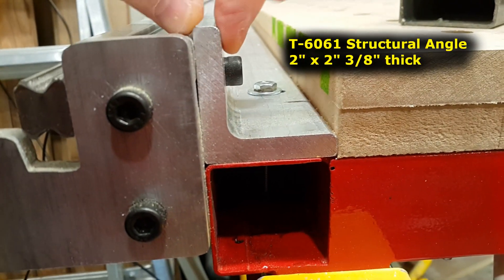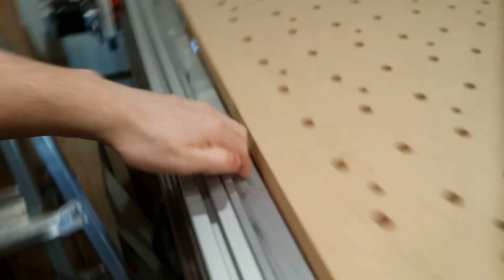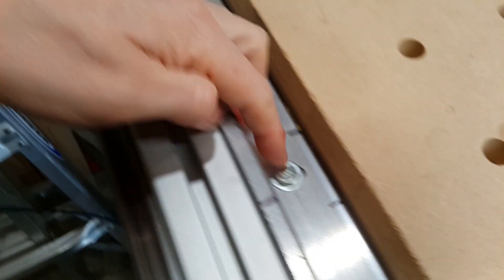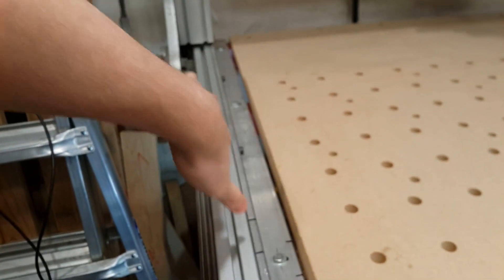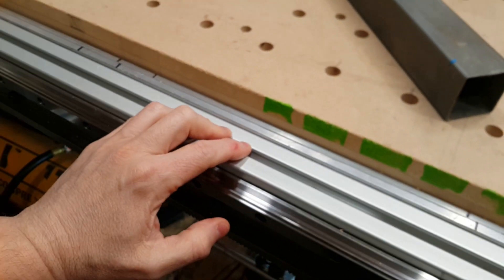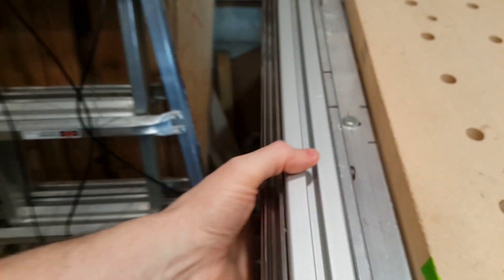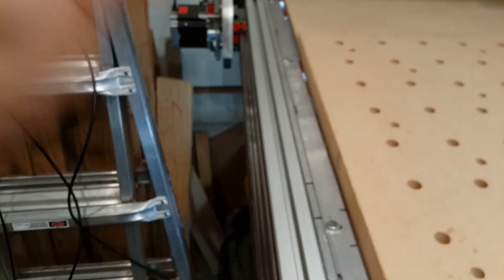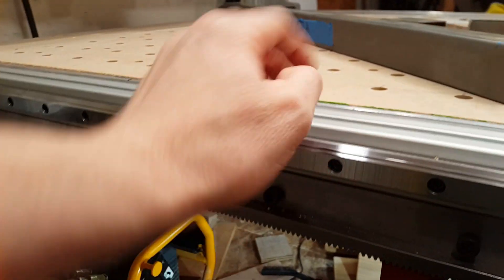This ended up being much thicker aluminum and seems to be working pretty well. I basically only have four bolts here, and if you can barely see it, the hole is slotted so that this entire piece can move laterally if it needs to. Since this is 80-20, it's attached by these bolts and the 80-20 can slide this way if needed. Both the linear motion bearing and the gear rail are attached to the 80-20.